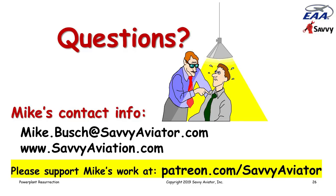Several people asking about Camguard. Rob's question might sum it up here. Can Camguard be used as a preventive measure and run constantly with each oil change? Absolutely. I use Camguard at every oil change. If I knew that the engine was going to be down for a while, I would put a double dose of Camguard in, a 10% concentration rather than the usual 5% concentration. That makes a pretty good pickling oil for aircraft engines,